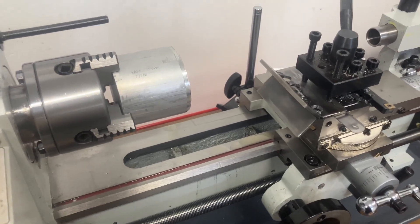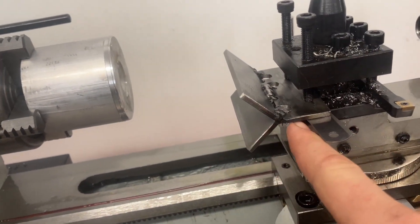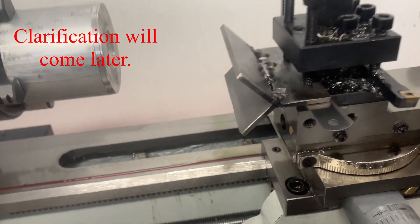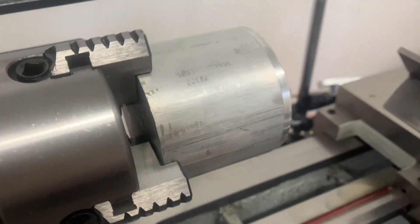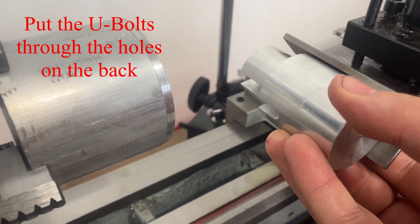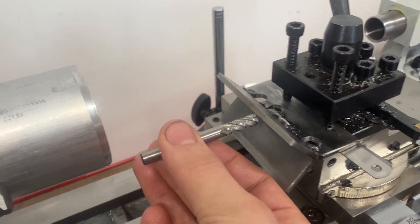Another trick and tool I use is to cut key slots or features in bar stock using this lathe. I've welded up a fixture where this angle and this angle have to be identical — it doesn't really matter what they are, they just have to be identical and you don't have to stress too much about it. You can adjust the height using shims underneath, similar to what I've done with the tool. Then using U-bolts you can clamp your work piece in, and your end mill — which would be in the chuck — is positioned here. When you do the cross slide it'll just cut the end mill through perfectly.